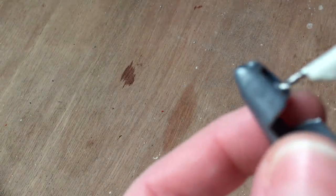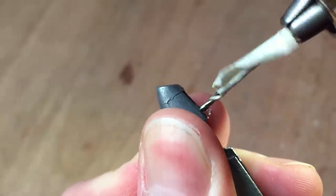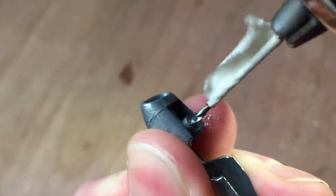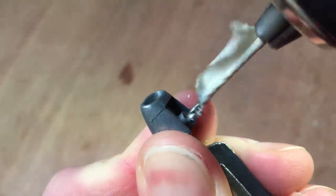After paint stripping I drill a hole into the rivet post in small steps at a time to avoid breaking the drill in the process. I also make sure that the start of the hole is in the right place so I don't run into the side of the rivet post when drilling deeper.